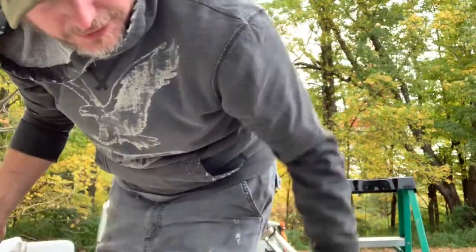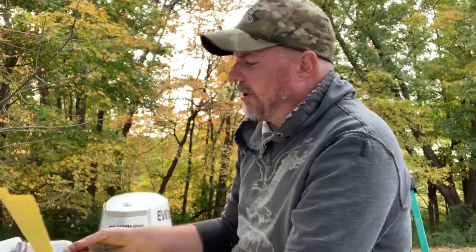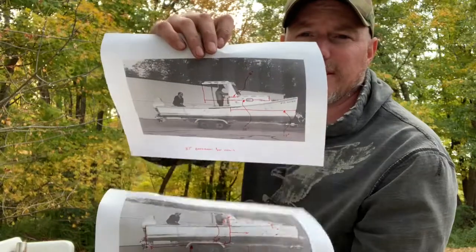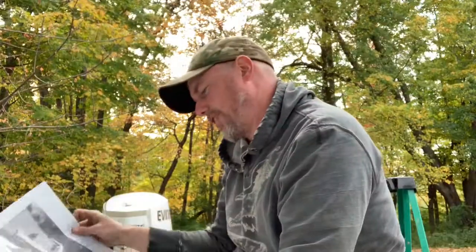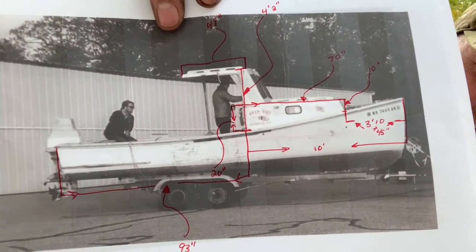I've got a folder here on the Down East Boat Forum. I found another gentleman who has a 21 Repco and had a nice side profile picture, because I really like the scale of his wheelhouse. So what I did was I took that photo — two copies that you can see here — and I scaled up a canvas in Illustrator and did a scale drawing so I could mark out where everything was going to be on the boat. You can see here I've got some of the dimensions and the detailed drawing of pretty much exactly how big — within an inch or so — of how big everything is.